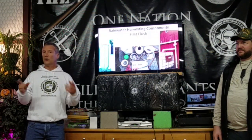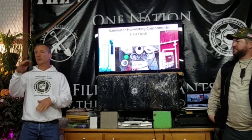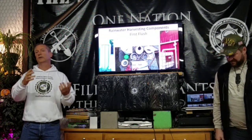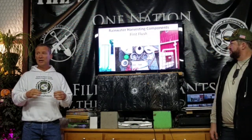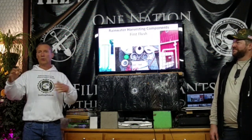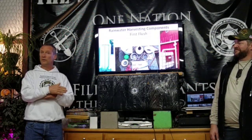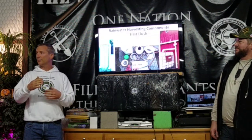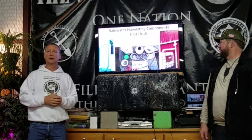Okay, so real quick, Darren was asking about the first flush. What happens if it goes for 4 hours? And I'll add on to that. Let's say it stops for an hour, or for 20 minutes, and then it starts again. The whole point of the first flush is to get stuff that has sat on your roof for days or weeks. If it's been raining for 4 hours, your roof is clean at that point, so you actually want it to go in your storage tank. And if it stops for 15, 20 minutes and then starts back up, that's still going to be clean. So it's going to fill up relatively quickly and go off to your storage tank.